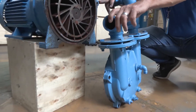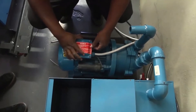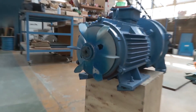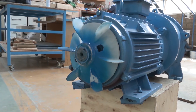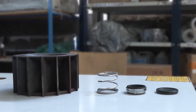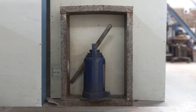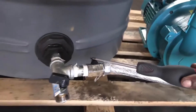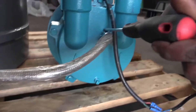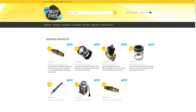And with that covered, let's talk about what we can do if something does go wrong. The most common problem is that the wire burns out on the motor — this can be repaired by an electrical motor rewinding specialist. The cooling fan is easily replaceable should it get damaged. And when it comes to the body of the pump, typically just replacing any damaged seals and replacing the impeller resolves the problem, but you do need a specialized tool to remove the impeller. Fortunately, AM does have one of these specialized tools. A qualified plumber can take care of any leaking issues from the water reservoir to the motor and back. And you will be pleased to know that AM stocks a large selection of parts specifically in support of the liquid vacuum pumps that it sells.